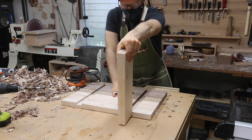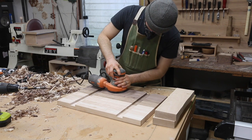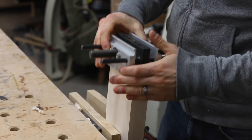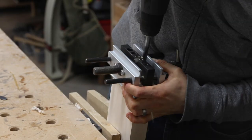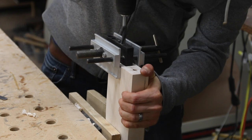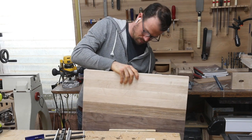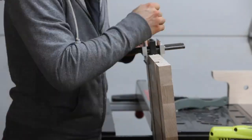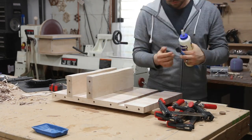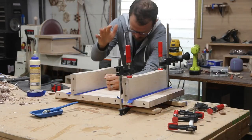This was a good excuse to get out my spokeshave to smooth it down. Right before glue up, I did a couple tasks that would be way more painful after. First, I sanded the underside of the top and both sides of the legs, being careful not to sand where the legs entered the dado since I already had a really good fit. Then I drilled holes for the dowels that would be used to attach the inner jaw — my general philosophy was two dowels in the end of each leg and then a dowel every three or so inches in the top. Probably overkill, but it's stronger. The dados made this glue up very simple, although I made it difficult on myself by deciding mid-glue-up that I wanted blue tape at the seams to prevent squeeze out issues. My advice is to make that decision before you spread glue.